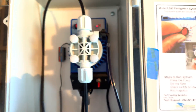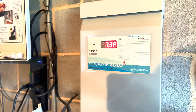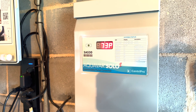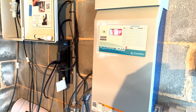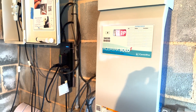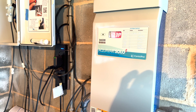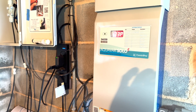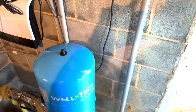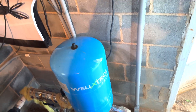My well pump is made by Goulds — it's a 3-horsepower pump. It's a constant pressure system; I have the pressure set at 70, so it runs 68 to 70 PSI all the time. The reason it reads 73 is because the pump has a soft shut-off — it runs just a few seconds after the water quits flowing. It runs a small 7-gallon well tank.